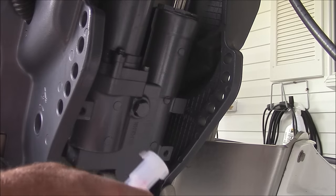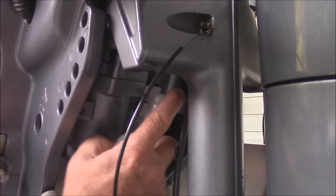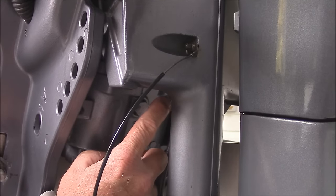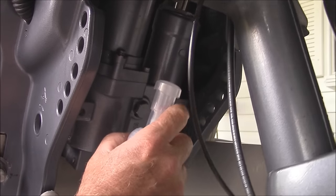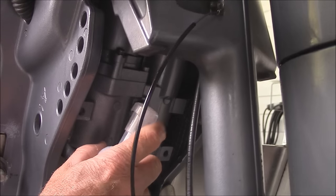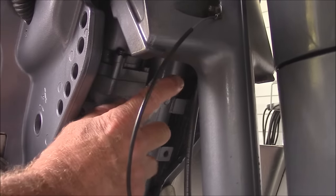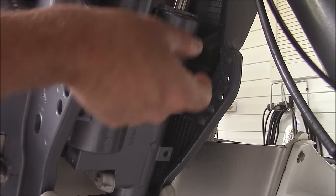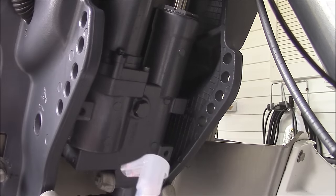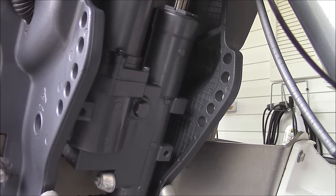Take the nut out, fill this up with as much as you can. Lower the engine, and when it's down as far as you can go without hurting yourself — don't pinch your finger — as the engine is raising, just start pumping the fluid in there. Make sure your cowling doesn't hit the poling platform. Keep pumping it in there. When it gets to the top, let it sit a minute, then lower it back down. Keep pumping it in there. When it gets back down, let it sit for a second, then raise it back up and keep pumping. What that's doing is sucking fluid into all the voids and filling them up. This little handheld soap bottle fits right into that little nozzle perfectly. You can also go buy a small oil can to squirt the fluid in, but we all have hand soap dispensers laying around, so it works perfectly. When it runs out, just pour some more trim tilt fluid in.